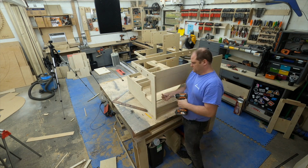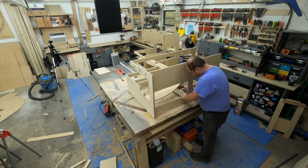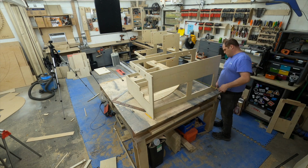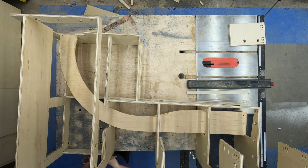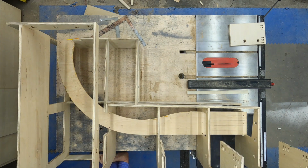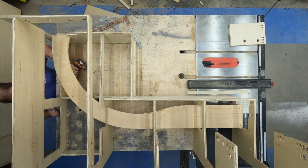Now, one thing I did do that's a little weird on this module from what I normally do is the backside of the 1/4-inch plywood sheet that's going to be installed for this middle deck is actually secured from the top on most of it, but that back edge, it's actually secured from the bottom. And you'll see that in just a minute here, but I did that in part because the clearances were that tight.